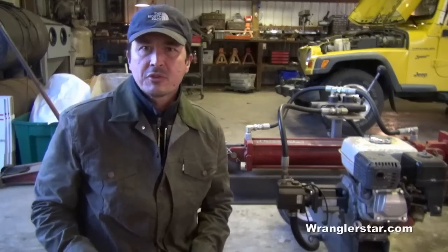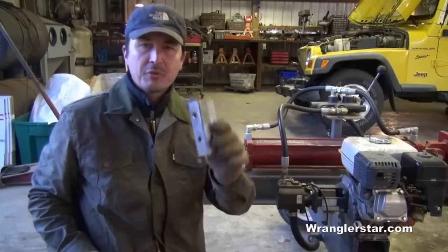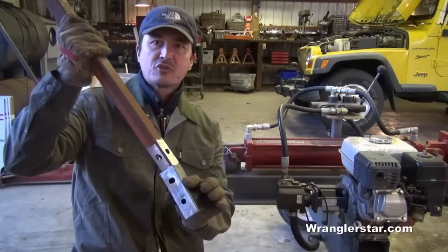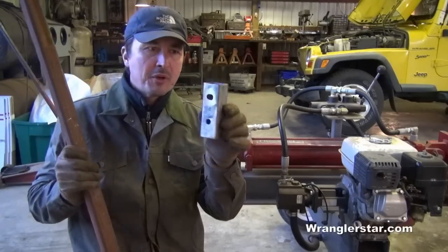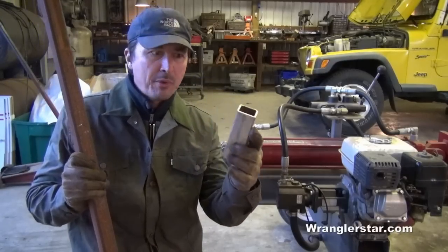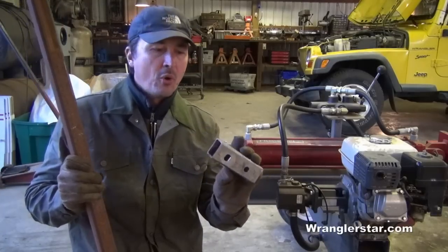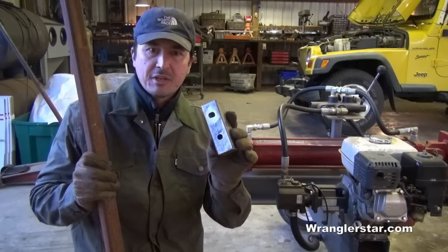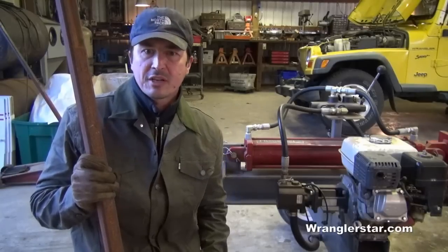But also I'm going to make sure that the system I'm going to put together is really modular. So utilizing some square stock, it's going to have kind of the trailer hitch style, where I can take another one of these and mount it on the side of a tractor bucket. Perhaps it could sit over the side, and as you cut it falls in the bucket, or a post in the ground if you had a designated woodshed area. But for me, we're going to get started with the wood splitter. So let's start putting it together, and I'll show you what I came up with.